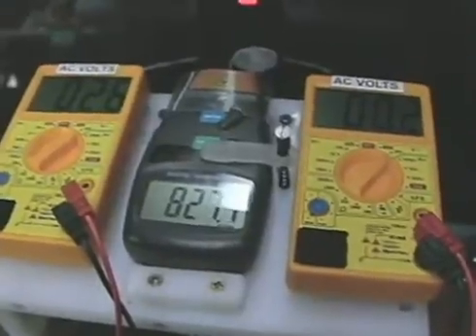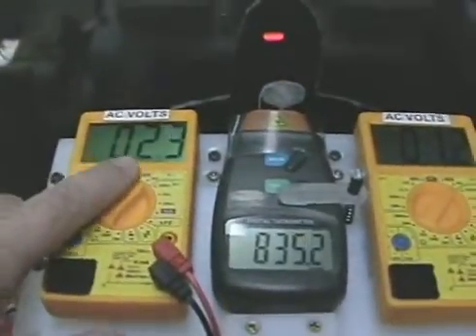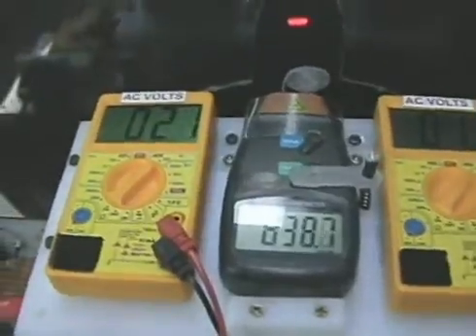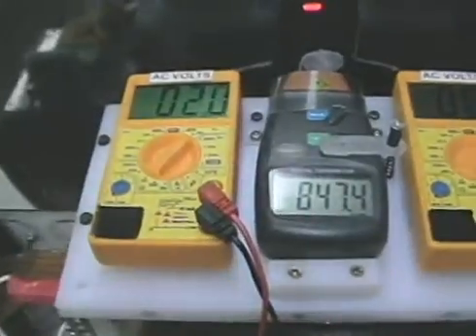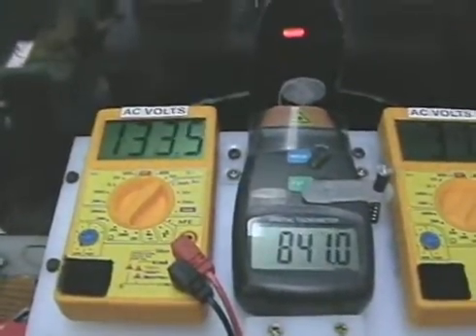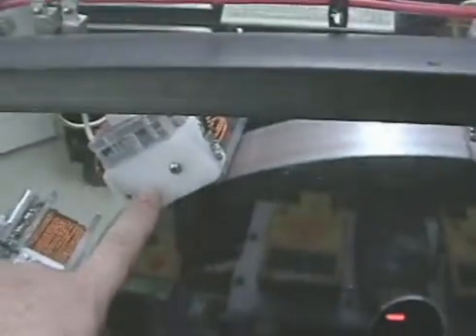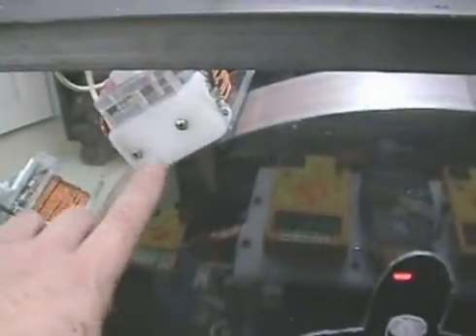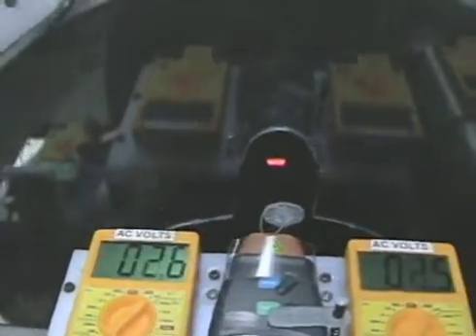It's still pretty abrupt when it kicks in. If you watch, this number will start going a little crazy and then it'll jump up to 130 volts. Because I changed the resistance, all these coils are now slightly weaker than they were before, so I have to add more. You can see it starts to go nuts — and there it goes: 130 volts. But it drops down because these coils with the higher resistance on the trigger of 4.7 kilohms are not sufficient to drive the wheel, so it drops back down. I hope to add a few more coils and correct that problem.